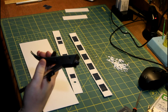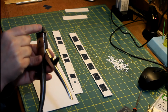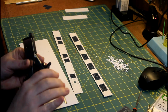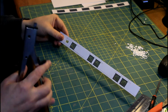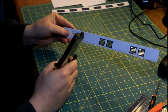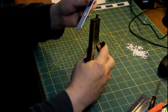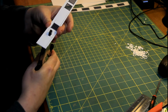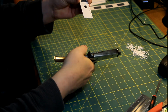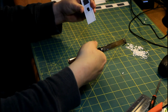Okay. And all it does is there's a little blade right here, and it has a little notch in there, and it just nibbles off bits of plastic until you get what you want. Alright, so this nibbler, very good to use, very easy to use. So you see I have the hole cut here, and I've already gone across one side of it, and this is how you work it. You just push it up through the hole like this, slide it in, and cut it off. And you just keep going like this until you have your hole completely cut out.